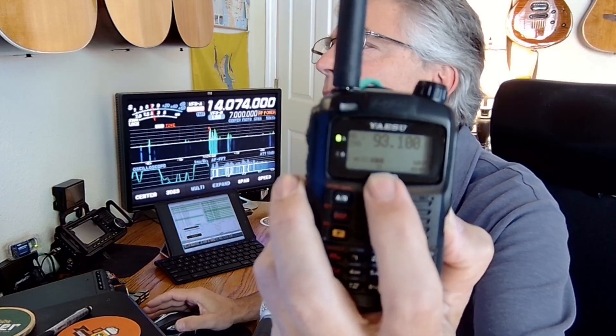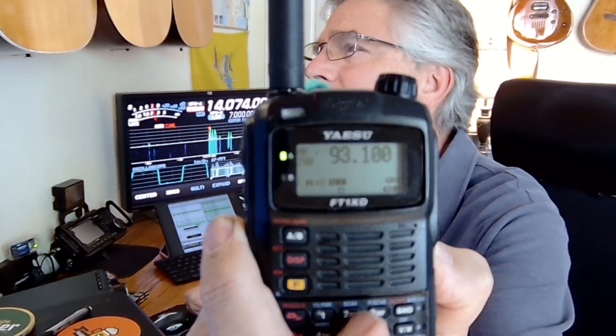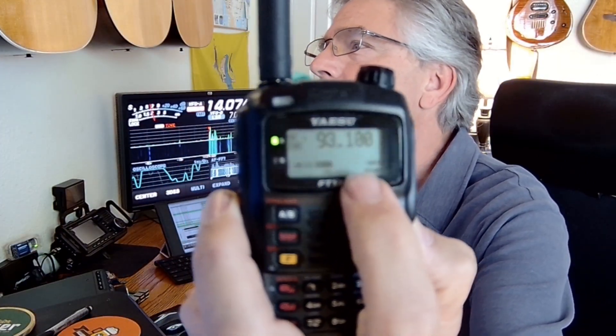One other thing that isn't obvious: most radios have an S meter — a little bar that shows your received signal strength. Especially on UHF, walk around while the repeater is transmitting until you get the maximum signal strength, and then stand there. Don't move. If you can hear the repeater really well, it can probably hear your HT really well too. Watch your S meter to find the best possible position to transmit and reach that repeater.